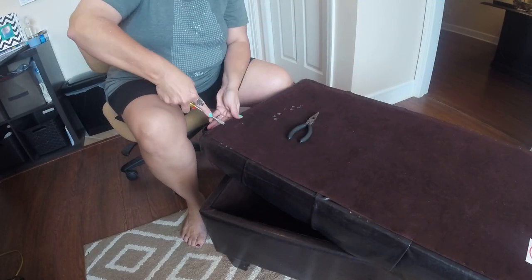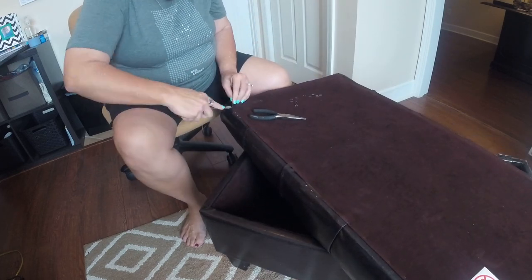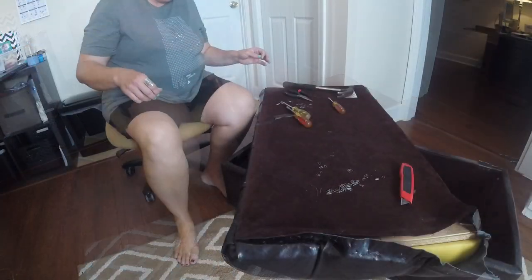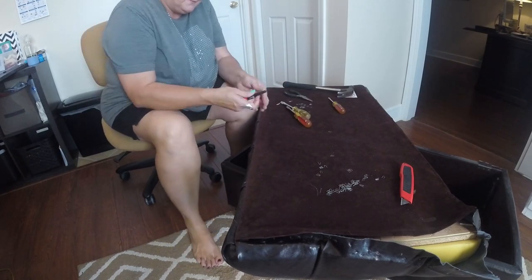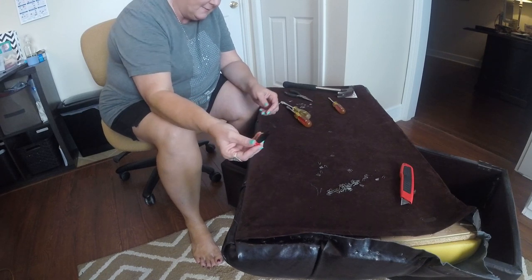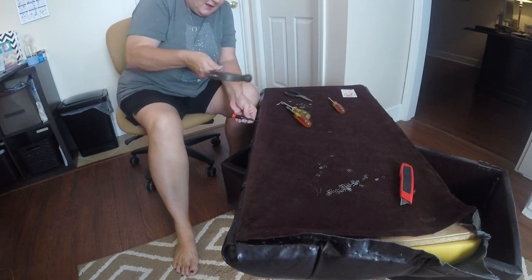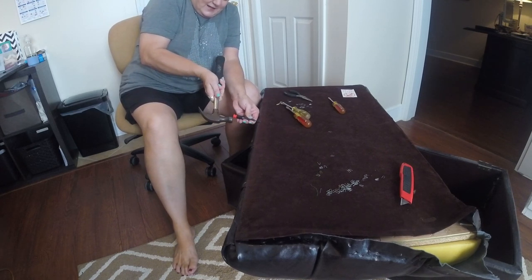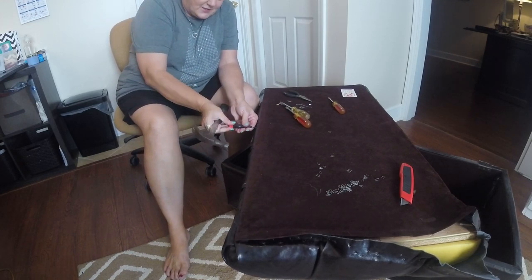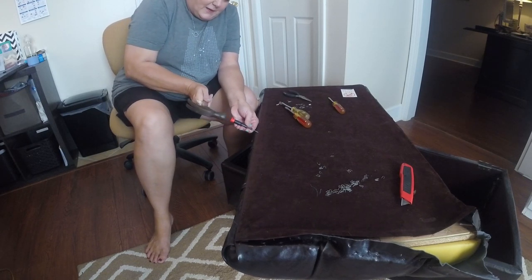As you can see, this was a hard, tedious job. It really took a lot of elbow grease trying to get this off and I got pretty frustrated. But my sweet husband came to the rescue with a great idea. I'm using a really small flat head screwdriver and my hammer — it fits right up under the staples. I tap it under the edge and give it just a little tug to lift it. Once I lift it, I can take my needle nose pliers and pull them out. It's the tedious part of the job, but it will be well worth it.